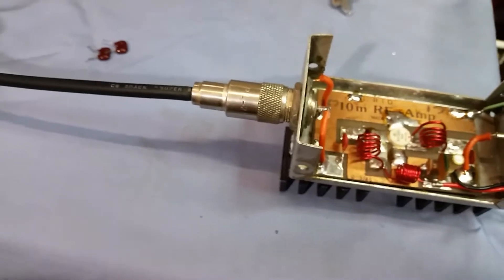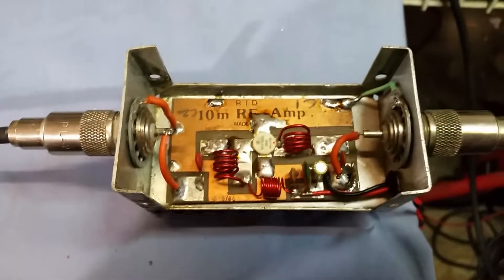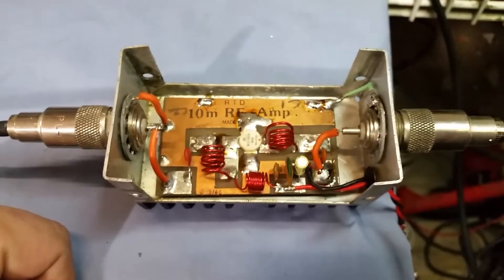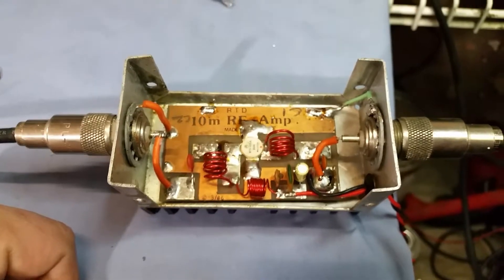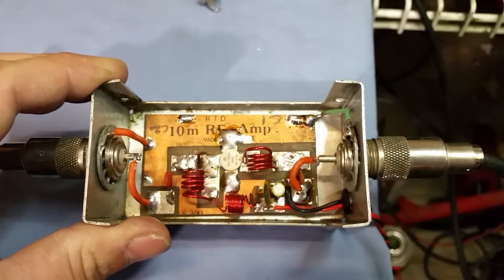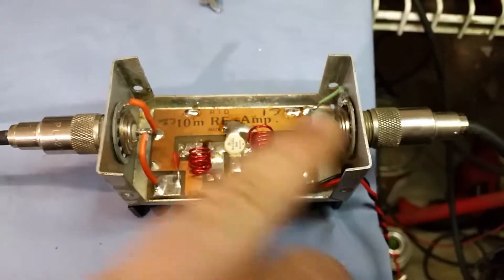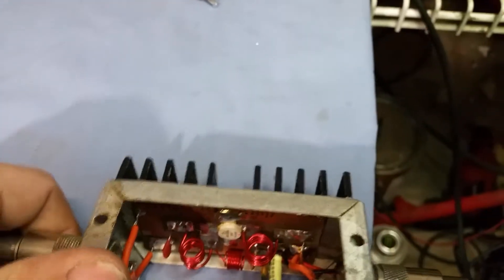These caps are a little bit too small - the trimmers that are in there. I'm about to put these 468s in there now. Also, you wouldn't be able to run this amplifier the way it is because there's no RF sensing circuit to bypass the amplifier when you're in receiving mode. So I'm going to have to drop a relay in here - a small one amp or three amp relay - and reroute the wires so you can have a sensing circuit.